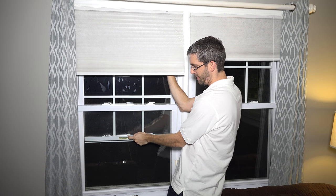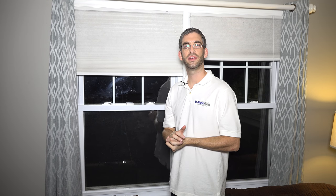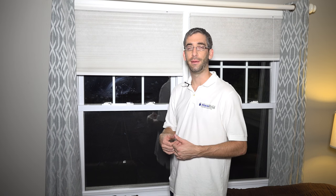Pulling down from the top, the magnet is still in place, separated from the contact. We've now demonstrated how you can use a single 5811 wireless door or window sensor to protect a double-hung window from opening either top to bottom or bottom to top. We hope that helps you save some money when designing your system. If you have any questions on how to protect your particular windows, please email us at support@alarmgrid.com, and make sure to subscribe to our channel as we'll be releasing more videos about various types of windows and doors.